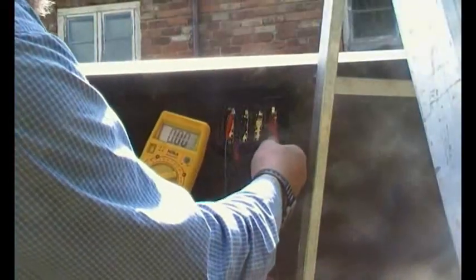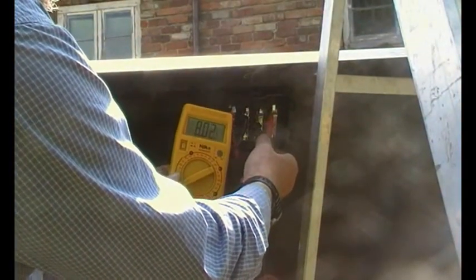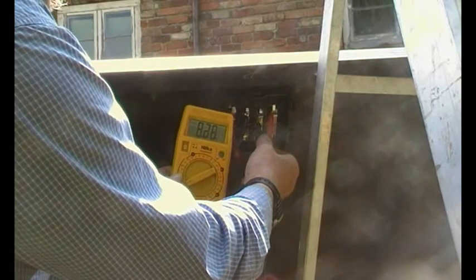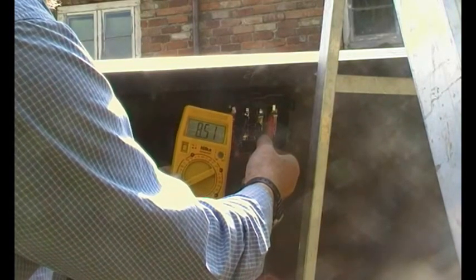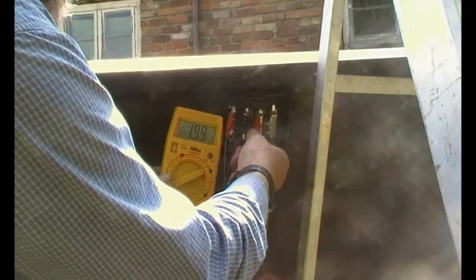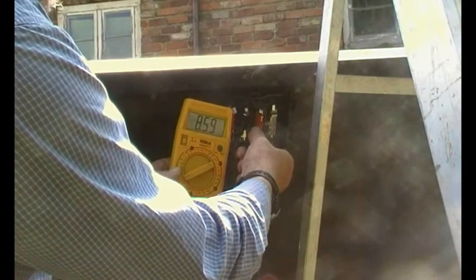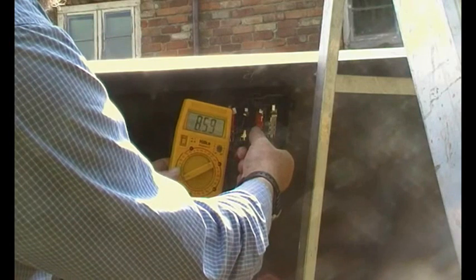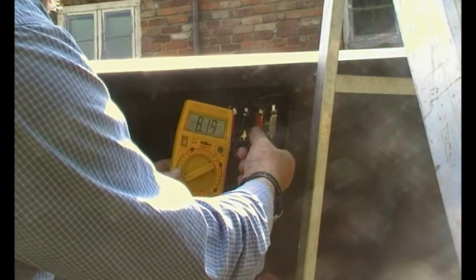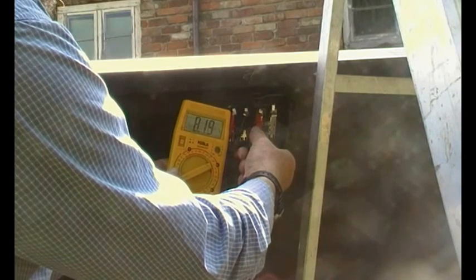Whilst this window of high sun is here, we have a short circuit current test. 8 — nearly 8.5 amps. Let's try the next one: 8.9, 8.6 variable. But we got the current there. And as you've seen with the bulb test, it was fairly bright.